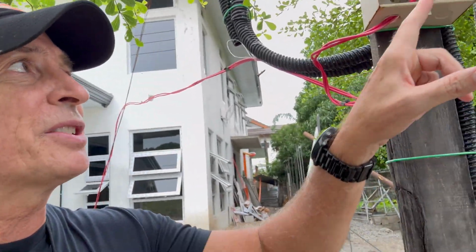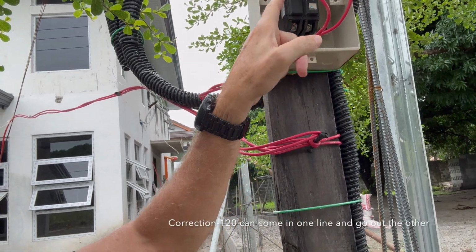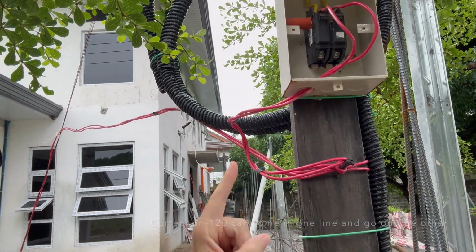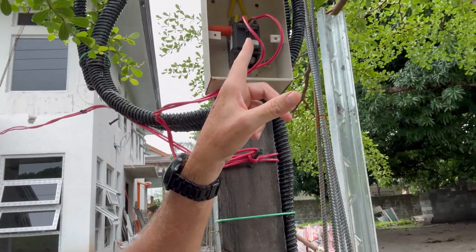And just in summary, that works by, since they're in completely 180 degree opposite directions, the 220 can come in one end and return out the other, and they do that both sides. So you don't need a return line for that system, which is the reason why they only have 2 lines running in here.